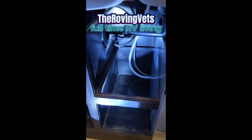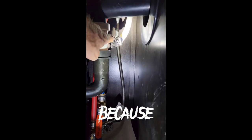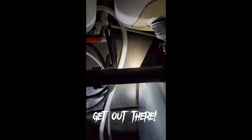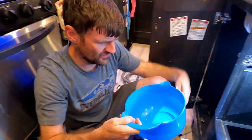All right, just wanted to show you my dishwasher install here. Got all the connections over here, put cutoffs for the sink while I was in there and added a drain line for the dishwasher up here. Had to modify it a little bit. Run it up and over so that it is higher than the bowls of the sink. That way the water can't run back towards the dishwasher. I feel like that's important. Right here on the water lines to the sink now, because I was messing around with the plumbing and moved them, I might have to address that now. But I ain't even mad about that, if this other stuff works good, you know?